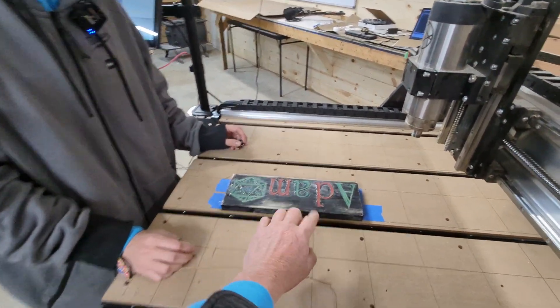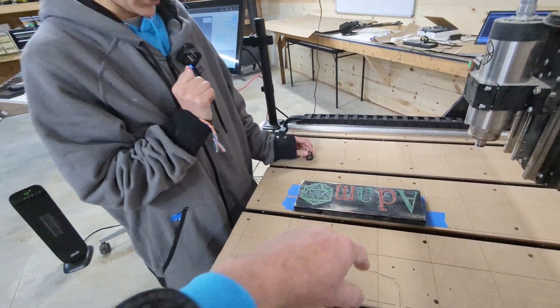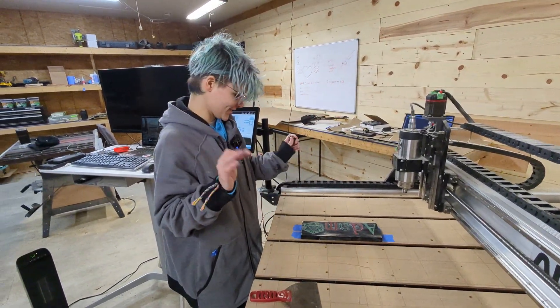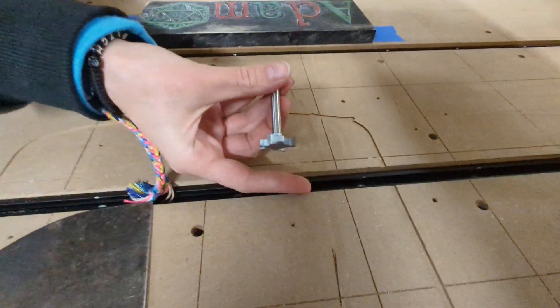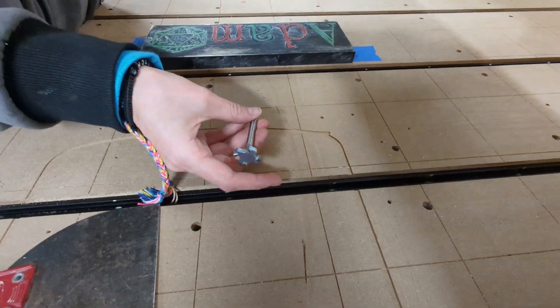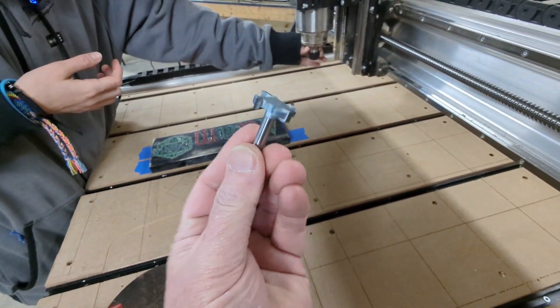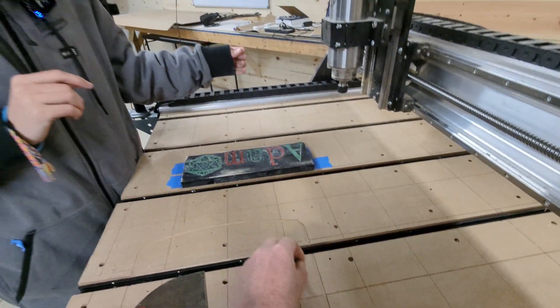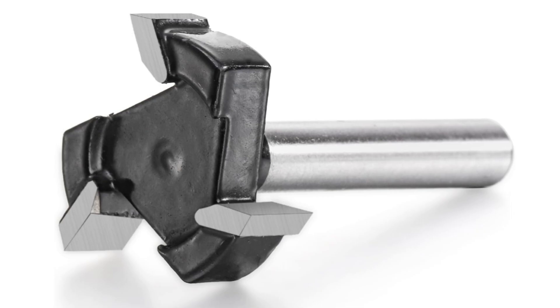So you put on that side, then you put on the other side. The ultra-smooth cutting IDC Woodcraft surfacing bit - this is one that I had designed, modified from your standard surfacing bit. I've worked with a tooling company, updated the grind angles on this and added a fourth flute for a nice smooth finish. The thing with the ultra-smooth surfacing bit from IDC Woodcraft - what you'll see out there are these one-inch bits with three flutes, often painted black. I used to carry those when I first started and I didn't like them. They weren't holding up well and not the highest quality bit, and that's why I went with my own design.